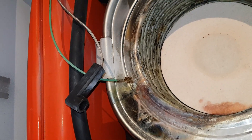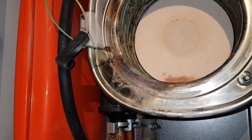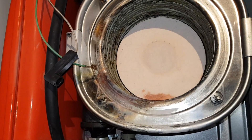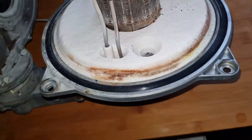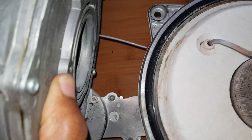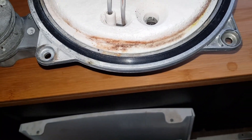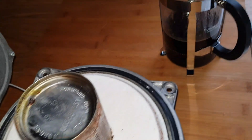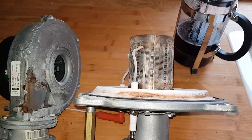The main thing here — look at this heat exchanger. It looks like it's warped to me; the heat exchanger is definitely warped. Looking at the seal on the burner, that looks okay — that's where the heat got out. The electrode is disfigured. So yeah, I think it's definitely the heat exchanger causing the problem.